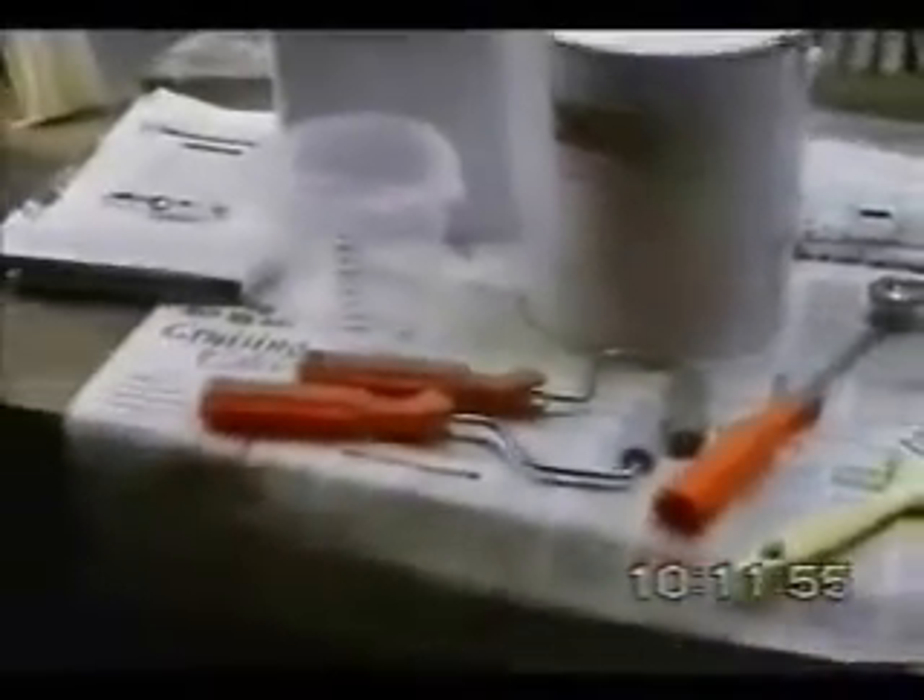Previous to that, there's about eight coats of wax on it so it'll release. These are all the pieces of chop strand mat with templates cut out for the wings — many different pieces. The first layer that goes on is actually called tissue — very thin pieces of glass — it's like a protective barrier, it stops the harshness of the chop strand mat showing through. All pieces cut out ready to go on. A good variety of materials and tools: resin, gel coat, measurers, mixing pots, and rollers and brushes.